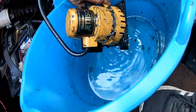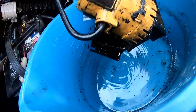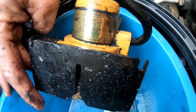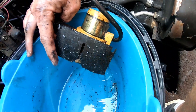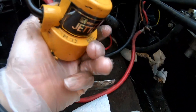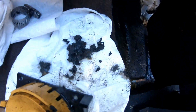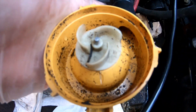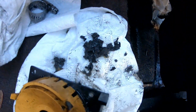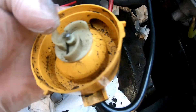I'm thinking that this thing was just clogged all to high heaven. But I'd still like to install a new one — this one's a 500 gallon per hour, maybe I'll get a 750 or 1000, but we'll see. I was actually able to get this cleaned off enough that you can see there's a lock and unlock — I pulled it off and been cleaning the inside out, that was all compacted in there. So that definitely was part of why it was being restricted. Look at all that — just oil and stuff from the years.